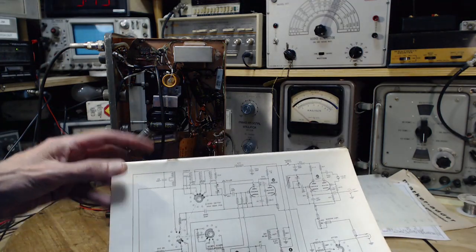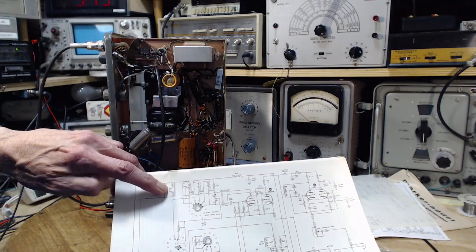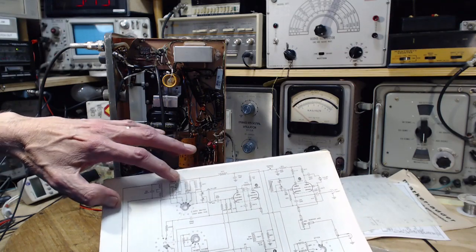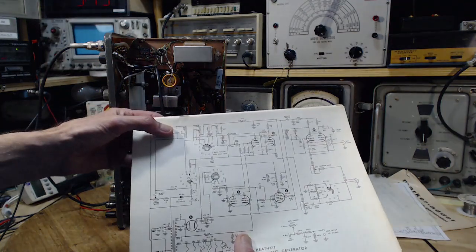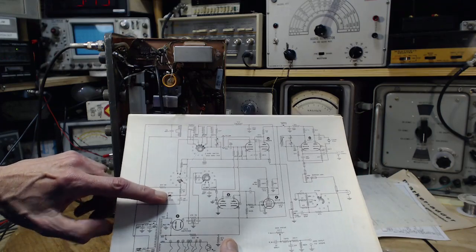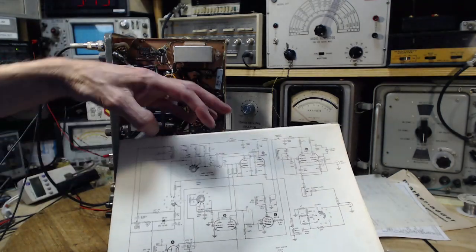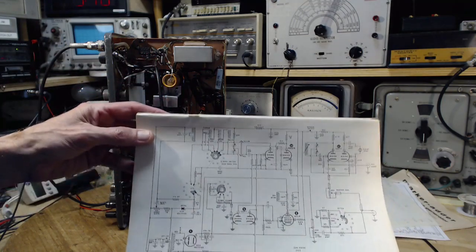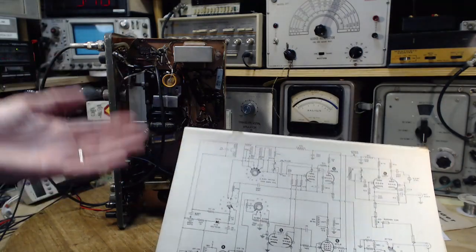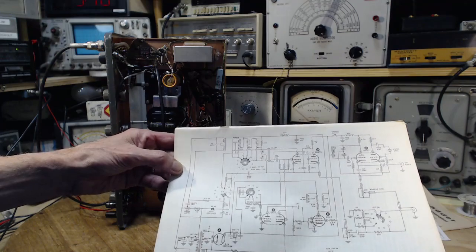So they're going to put DC through here, and it's going to affect magnetically all these cores. Where do they get the DC from? They get it from here. Why do they even need it? They need it to put this into a certain range of operation, if you like. And this is a bad explanation, and I may even have it wrong because I've only read it 3 or 4 times over. I haven't got to 5, 6, and 7 yet.